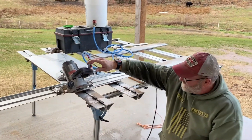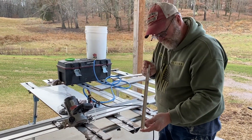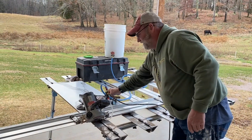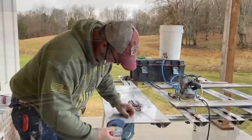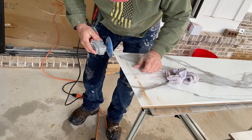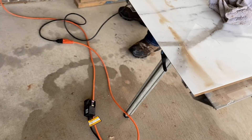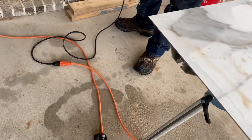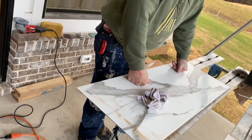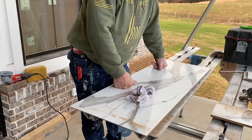What do you think of that blade? That right there was freaking amazing. That was far and away one of the best miter blades I've ever used. I would call that a well-mitered edge right there. Keep in mind, we're working with 7/16-inch thick porcelain — this isn't gauged panels, this isn't thin tile. This is thick, hard tile.